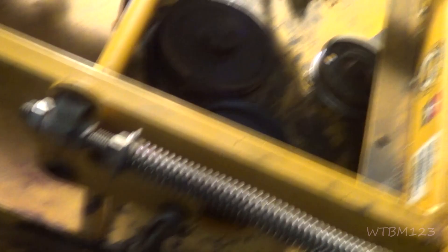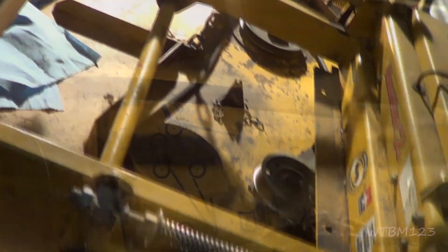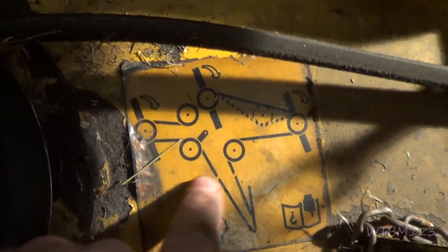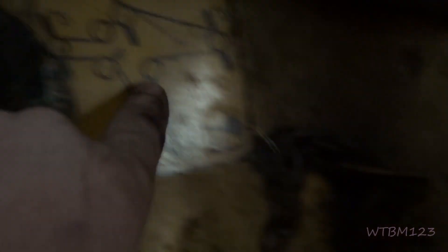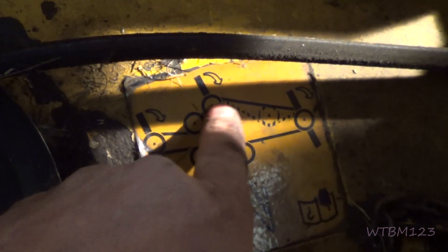What we're going to do now is go ahead and put the belt on and change the mower blades — we don't have bearings yet. Right here is a picture of how the belt goes, coming up around here. We don't have that other idler, that's where it's dotted, so we're just going to follow that diagram — come up here, come around, down. We'll get the spring chain hooked up, and then you've got to get the right tension on that chain.